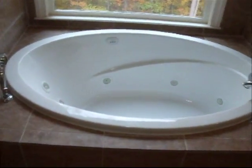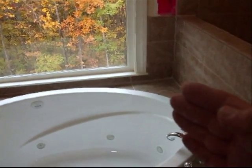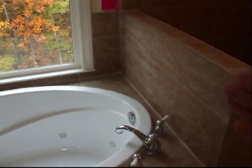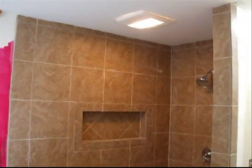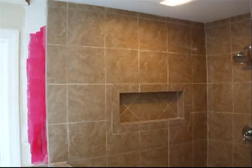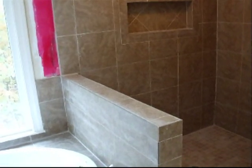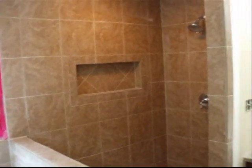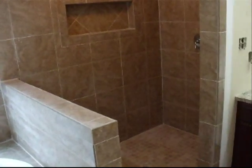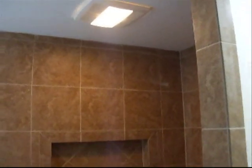The old tub was actually pretty short — it went up to the edge of the window here. We needed about another eight or nine inches, so we made a knee wall and took out the whole shower. That was about a ton and a half of material — the old lathing, mortar, lathing situation with the lead pan and everything. That took about a day, day and a half just to do the tear out, which is unusual considering the age of this house. The new shower was built without the wall to open it up and bring in more daylight.